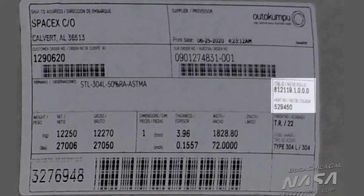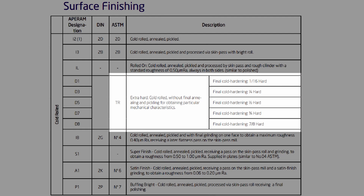On the right of that, there are two proprietary ID numbers for the roller and the ingot, but the third line is the identifier of the finish, which is based on standards. The TR finish denotes that the steel is extra hard, that it is cold rolled and without final annealing. Unfortunately, it does not say how much hardening the roll went through. I could not find the meaning of the "22", so please, if any one of you knows, write it down in the comments.